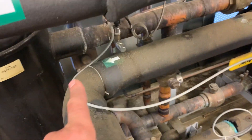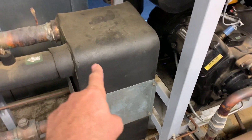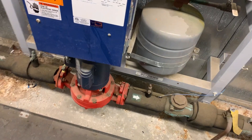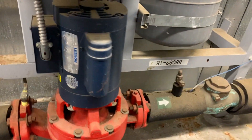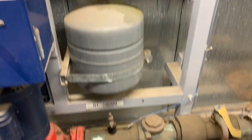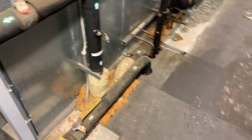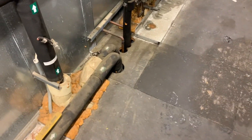It's hard to get a good look — we're so up close — but there's the discharge gas going in, and this side is the glycol going through the pump. There's our little circulating pump for our glycol heating loop for the reheat coil. That's just a little constant volume pump, and those pipes are going down there and out to the air conditioner.